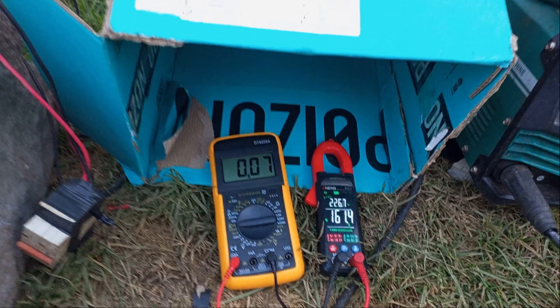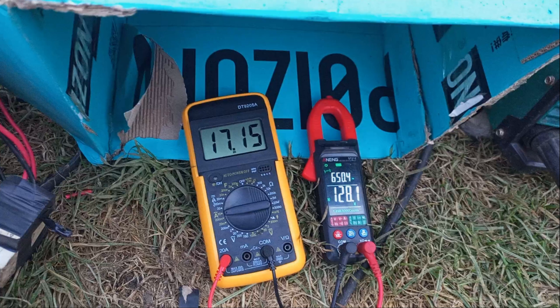With no load I'm only able to get to 161 volts and an output frequency of 226 hertz. From the video that looked inside the PMG, you saw that we had 12 magnets of alternating polarity, so for every rotation we get 12 outputs. Doing the math: 226 Hz multiplied by 60 divided by 12 gives us 1130 revolutions per minute — that's the current RPM. After connecting the load, the output voltage and current fluctuate a little because it's not a resistive load.